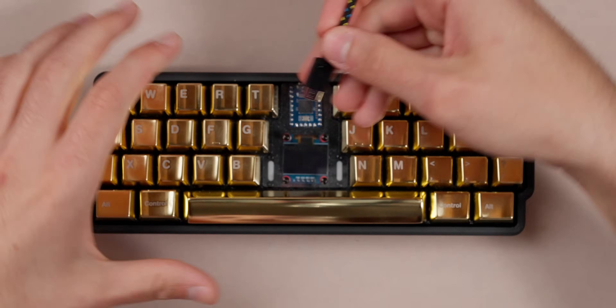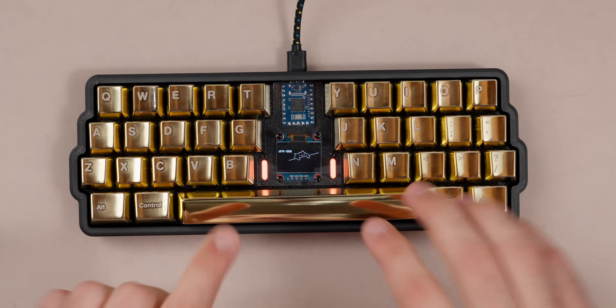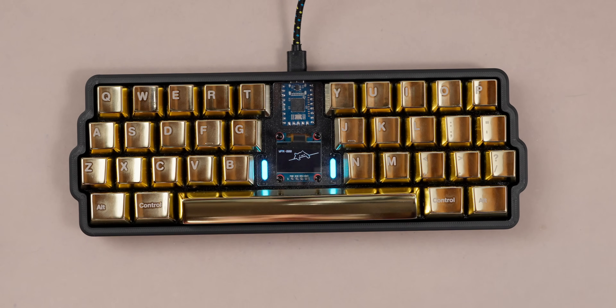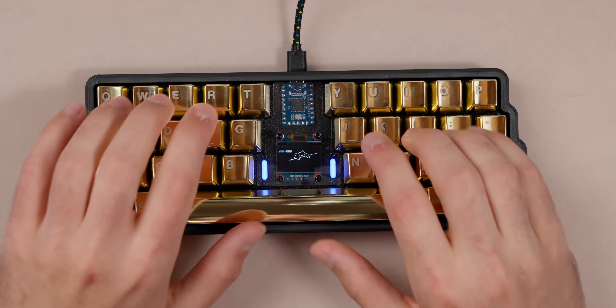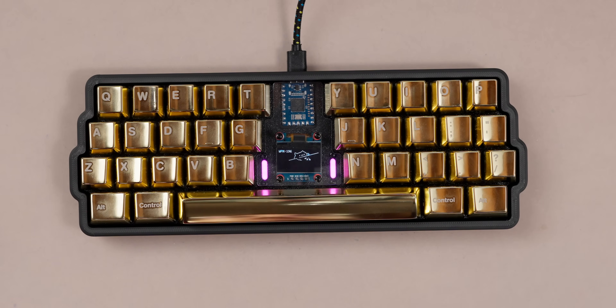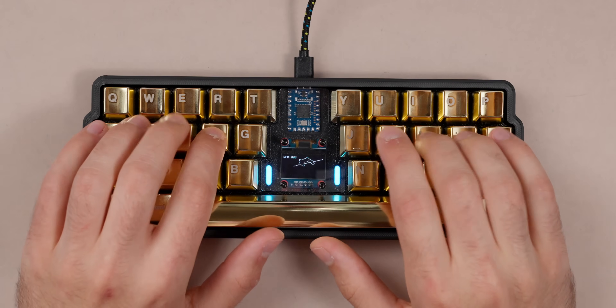I'm going to grab a USB cable and plug it in — and you can see we have a bongo cat on the OLED and our little RGB here doing its thing. Eventually I'm going to set it up so activating caps lock changes the RGB to a certain color, and I'll use RGB for layer indicators and other things. For now it's just cycling through RGB. If I pretend to type, you'll see bongo cat doing bongo cat things, and it also shows your words per minute up there — though I'm not sure how accurately QMK calculates that. We have to do a typing test because this wouldn't be a keyboard build video without one.